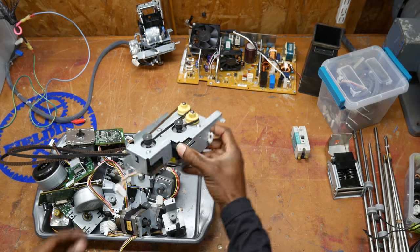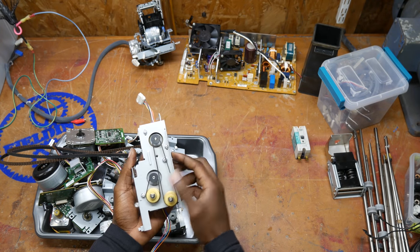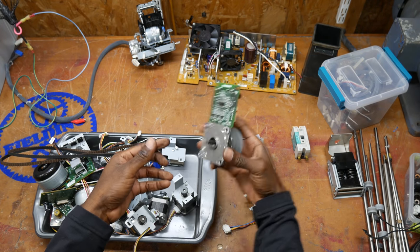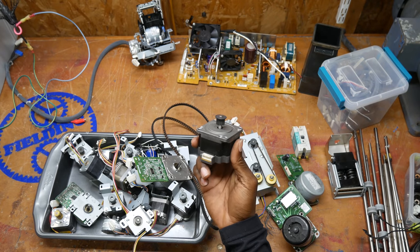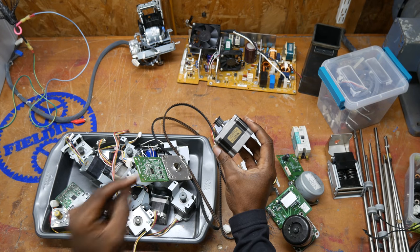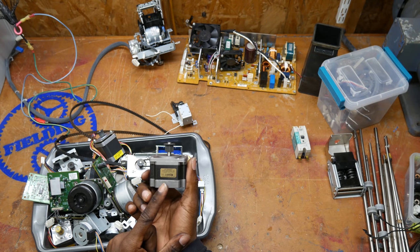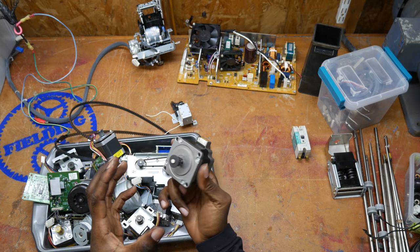What I really wanted to show you is all of these stepper motors. These two are mounted together with timing belts, and there are a large number of these motors inside the printer — this is just a sample. This is the kind of thing you find in a CNC machine because it allows very precise movements and repeatability — you can go back to the same spot over and over again. Stepper motors are really only useful for machines that require precise movements. Other things make them difficult to use, like the kind of odd voltage — this one, for example, operates at 2.1 volts.